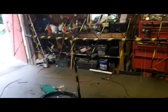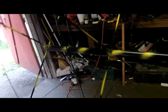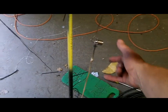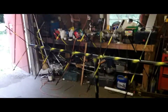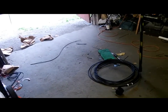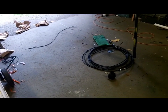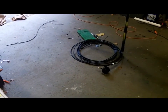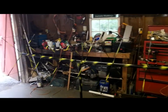I hope this inspires you. Matching it can be a challenge. I was going to do tuning stubs — you can install tuning stubs on every single element. That was my last resort, but I was able to snap it in line with a piece of 75-ohm quad shield. I don't like using quad shield on VHF — the higher frequency you go, the more loss in the coax. That's 46 to 50 feet of 50-ohm coax. One quarter wavelength, 75-ohm, nine turns for a choke on a two-inch core. Jack it in and have fun. 73, good luck everybody, thanks for watching. K1 GMM.